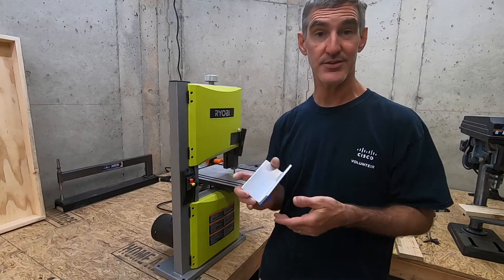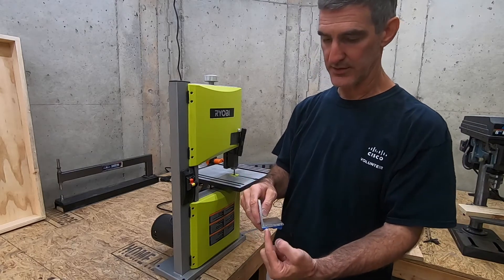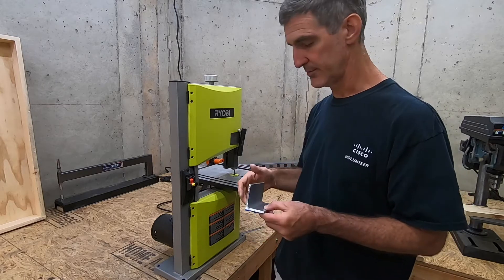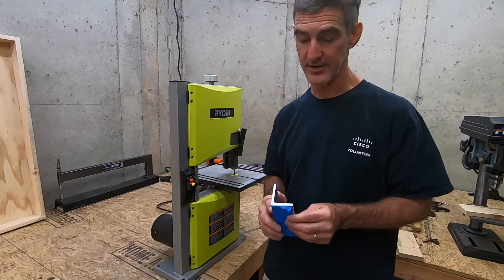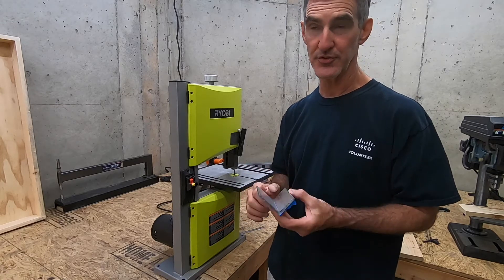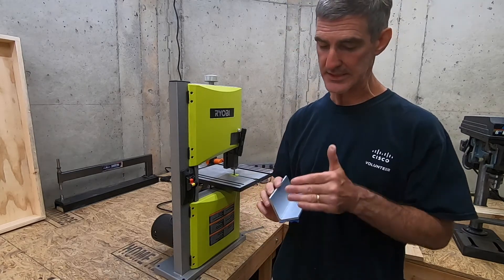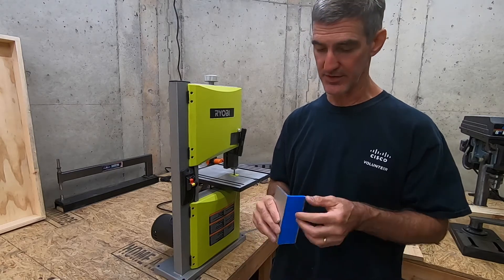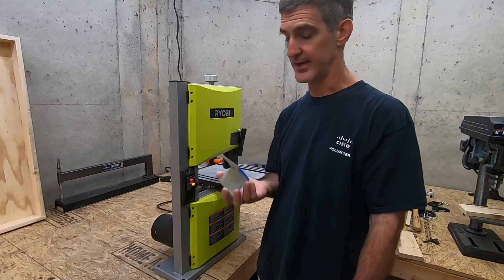It's a six dollar part, so if I screw up I'll just buy another one. I'm going to feel my way through this. The first cut I'm going to make is the dimension of the bracket - the bottom part is one inch, so I'm going to cut it off at one inch, leave a bit extra, then come back and work it on the sander and file. Then I'll figure out how to chop it into pieces - there are some angles to cut and drill holes to locate precisely. I may drill first before filing it down to final size, that way if I'm off with the drilling I can work my way into it.